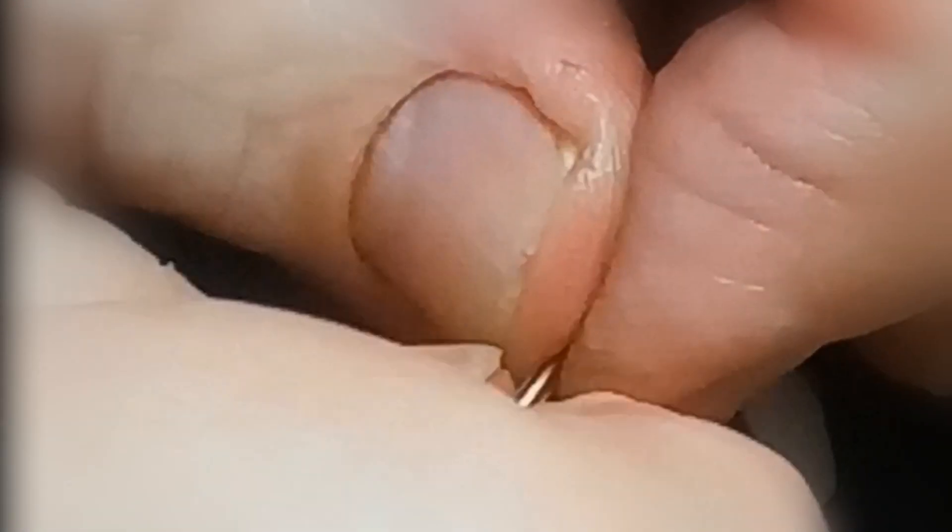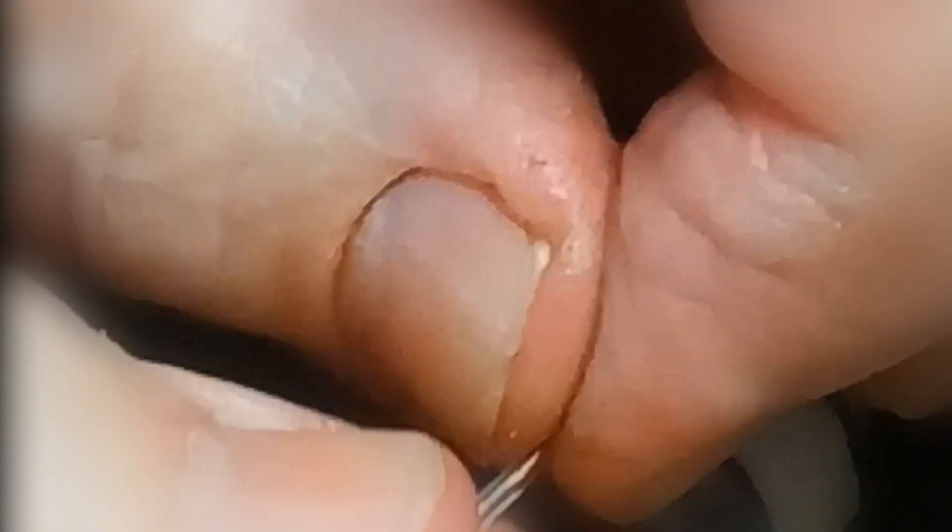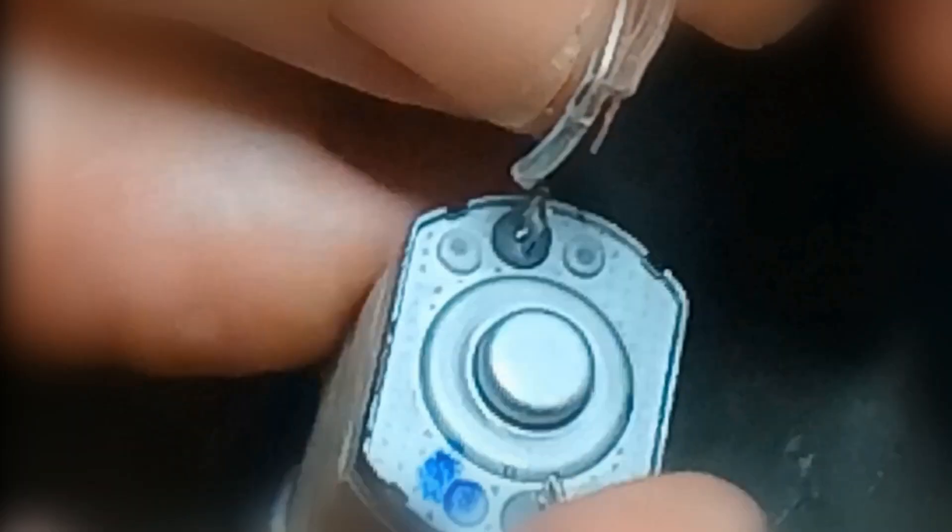At this point I'd normally give it a good twist to make sure the wires are nice and neat, but you have to be careful that you don't stick it in your fingers. Also, you can see here the wire's not particularly clean — it's not a nice bright copper color, so it may not take the solder straight away.